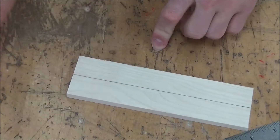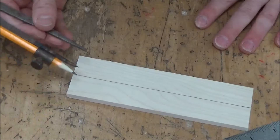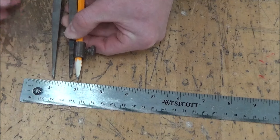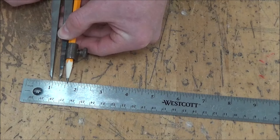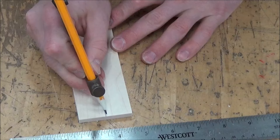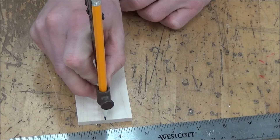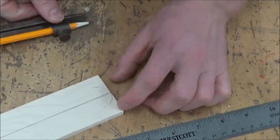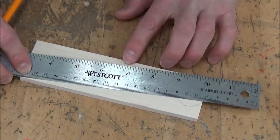The top of the flipper has a radius or a curve. If you look at your multi-view sketch, it says it has a radius of one half, which means it has a diameter of one. We're going to sketch that curve with a compass. I need to set my compass to a half inch — the spike, without a pencil, I'm going to line up with a whole inch mark, and I'm going to close the compass until my pencil lead points to the half inch mark. Then I'm going to line up the pencil lead with the edge of my board and put this spike right here on my line. I'm going to apply pressure down on this spike — not a whole lot of pressure on the pencil lead because it'll break — and I really only need about a half circle here. We're going to draw a line going from this corner to the side of the circle that is farthest away from me.